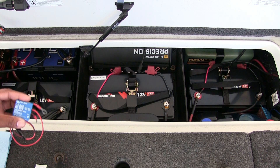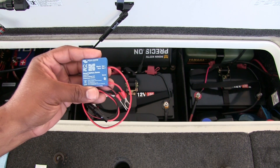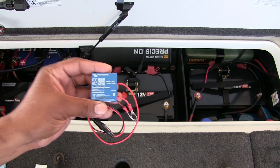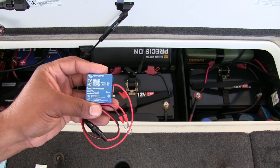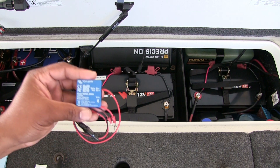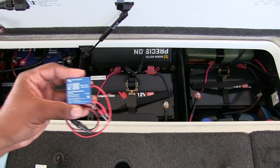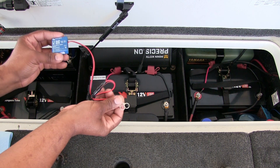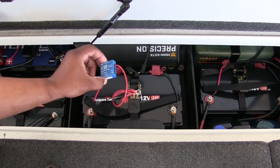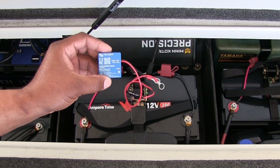That's why I was flipping through pages on Amazon and came across this Victron Energy Smart Battery Sense module. If you don't know about Victron, they make all types of BMS systems and controls for solar applications, but I believe this will work on boat lithium batteries so you can see the state of charge. They only have two simple connections — one for the positive and one for the negative — and they have a sticky back so you can stick the sensor to your battery for the temperature sensor to work.